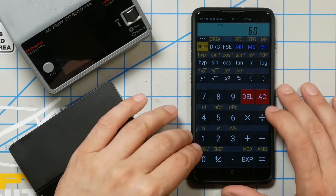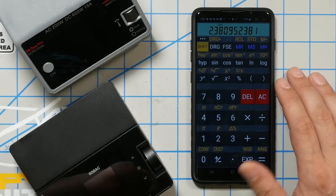A 1C charge rate will charge a battery in about 1 hour. A 2C charge rate will charge a battery in about half an hour — a nice rule of thumb. So for a typical FPV pilot using typical 1500–1600 mAh packs, the 608AC is more than capable of charging them at a 1 or 2C rate. On the other hand, if we go to something like a 6S battery — 60 watts divided by 25.2 volts, that's 6S voltage — it's going to give us about 2.3 amps. So we can't charge quite as fast at 6S as we could at 4S. But still, that's not bad: 2300 mAh 6S in 1 hour, or 1100 mAh 6S in about 30 minutes.